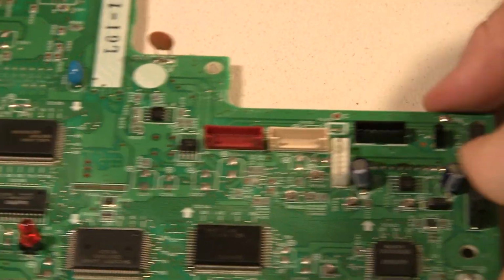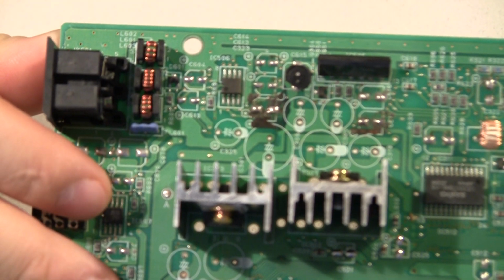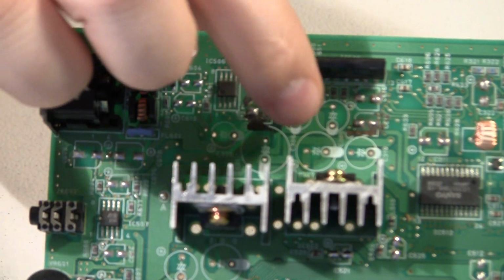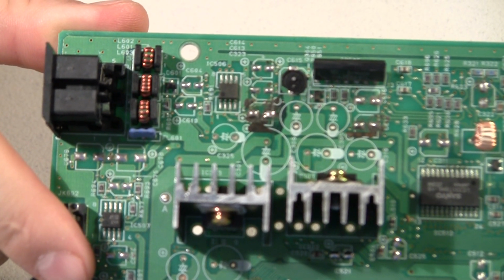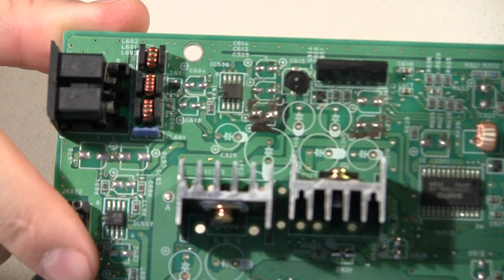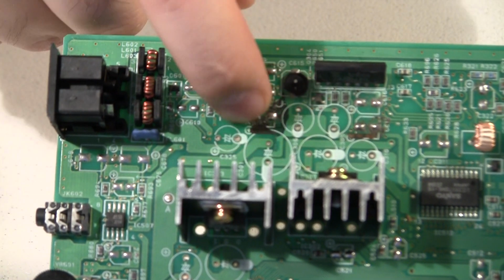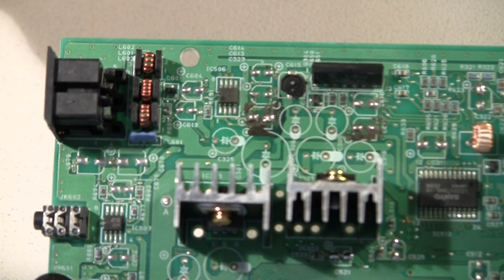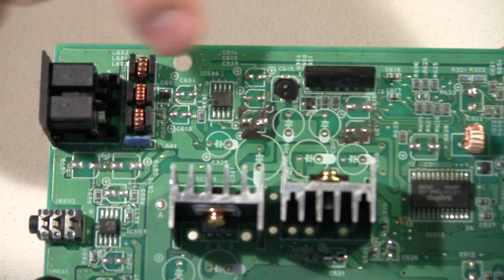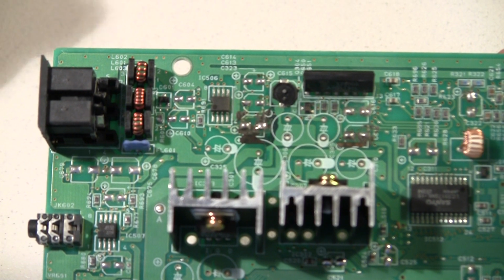Okay, something else I'm also worried about is after I cleaned it up, there's quite a few spots in this area that were really badly corroded that didn't really show through until after I cleaned it up some. So I'm probably going to test the traces from the pads to whatever vias or wherever they're going to make sure that they actually do have continuity on them before I solder a bunch of capacitors back on everywhere and can't access them as well.